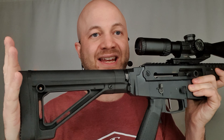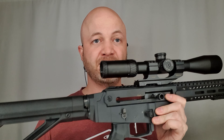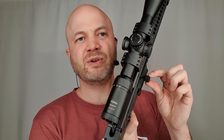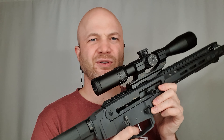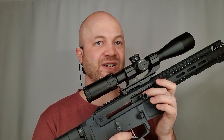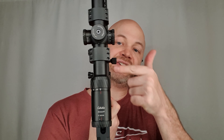In terms of the changes that have happened to the WK-180C, there's been a couple of things. This is a fairly early generation version — I've had it for a while, taken it to a three-gun and hunting, and it's performed really well. One issue is the early floating charging handle would kind of booger up the aluminum on the inside of the receiver. Some people didn't like that, so Kodiak designed a magnetic one that stuck to the bolt. Then they went to a screw-in one, but a couple of people have been having them snap off. Companies like Spectre Ballistics have released an aftermarket one that's quite a bit more durable.